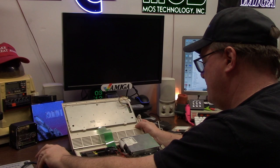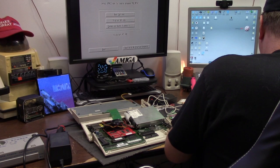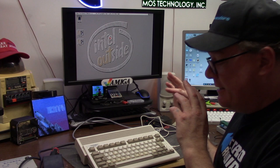Okay, and I forgot to plug in my Furia. I'm using the GPIO header pins. 3.3 volts, pin 1 and 2 are the ground on that. So there we go. That is your 3.2.1 ROM upgrade with an erase, a reflash on the EEPROM, and a check for what the two boot screens are, your normal one, and one if you have no devices connected.